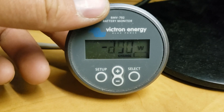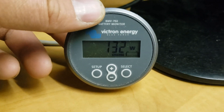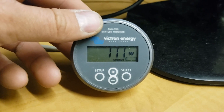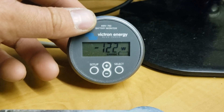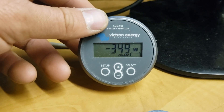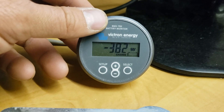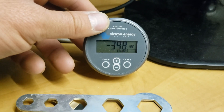Okay, so even though the generator is running — we just went to plus, something must have shut off, so we're only putting a hundred watts into the batteries but it's running everything in the house. Looks like something turned on — now we're pulling power from the batteries again because we have an 8000 watt reliable inverter running directly off the batteries, separate from the charging system.